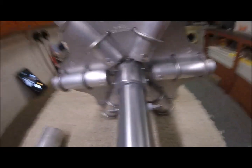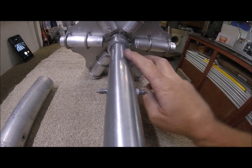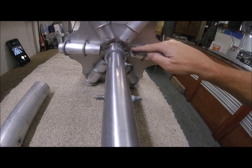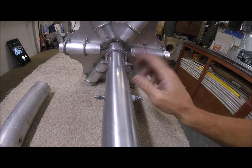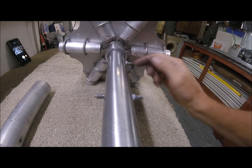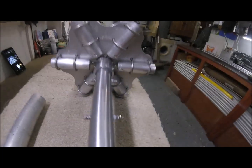The cap screw lines up with the arrow. More importantly, we need to be running horizontally across the base plate, because this is where the wires will go off. So long as it's thereabouts, that's fine - located between six and one facing the arrow. And we get the three point studs running horizontally across five and two, which are engraved there. Once you're happy with that, we can tighten the bolts up.